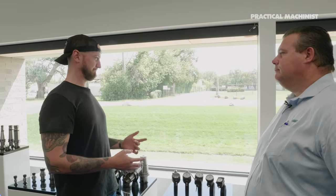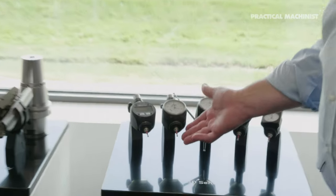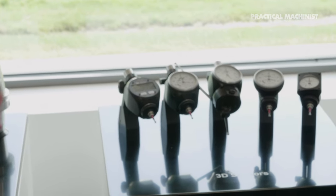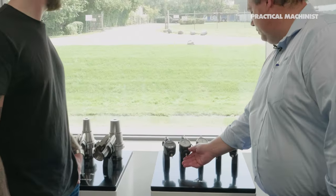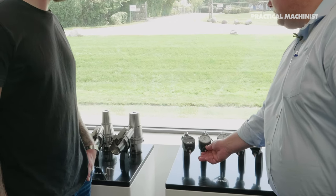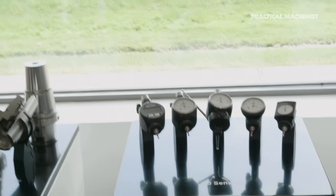Why is it called a 3D Taster? In our catalogs we call it the Haimer 3D Sensor. The idea is it can replace an edge finder and do basic probing in an analog fashion. With a traditional edge finder — we call it a wiggler — you bring it over next to the part, the bottom portion separates, you zero the control, move out, jog over half the diameter, and zero again. With the 3D Sensor you bring the red hand to six o'clock and the black hand to 12 o'clock and you're on the side of the part — zero your control, you're good, no need to move anything. It also has an indicator so you can check flatness, parallelism, and perpendicularity.